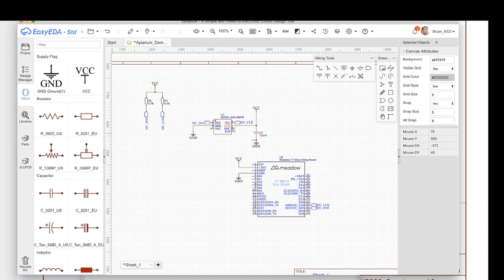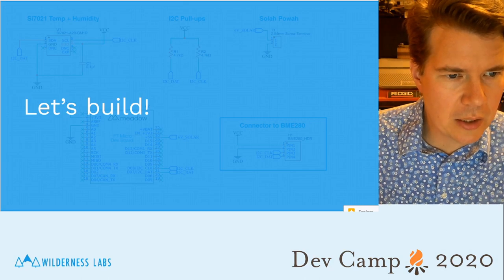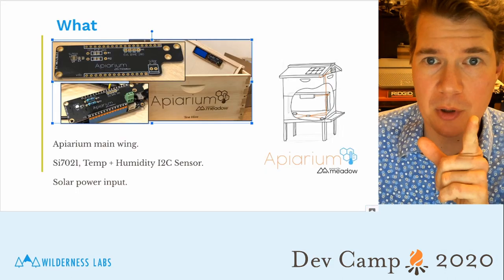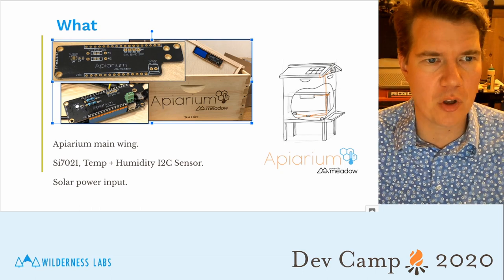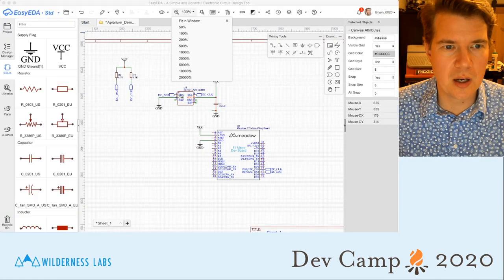There's one other thing that I want to put in on the design. Let me show you on the picture of it here. I want to put a little connector, a little terminal mount. You can see this thing right here, this green thing. I want to put a little screw terminal for my solar power coming in, and then that's going to hook to the 5-volt pin on the board. So switch back to my PCB view,